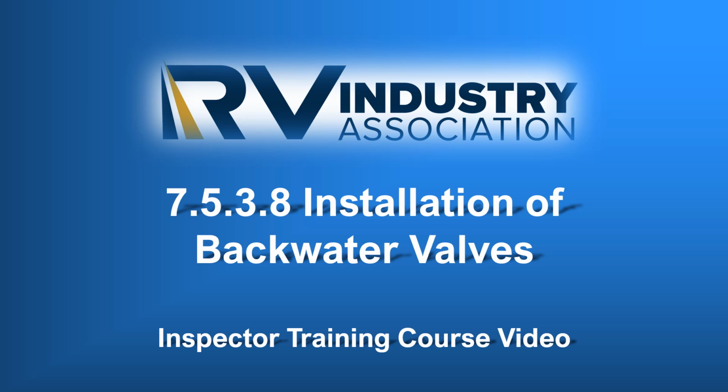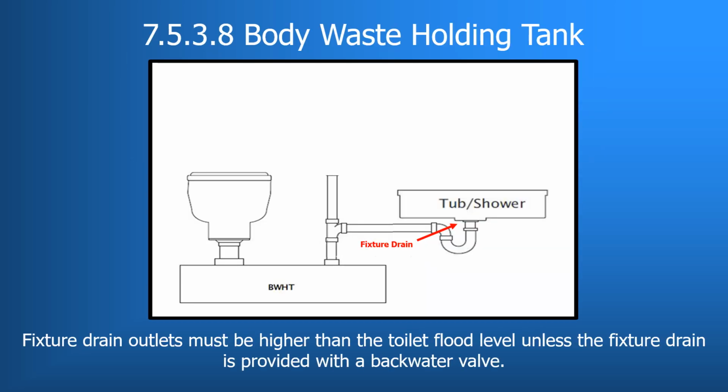All right, in this brief video, you will learn what a backwater valve is, what its purpose is in the drainage system, and how it should be properly installed. Under 7538, an additional valve is required to prevent wastewater from backfilling into the fixtures. This is true for both black and gray water holding tanks.